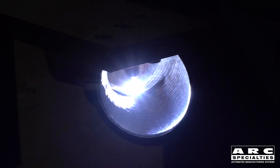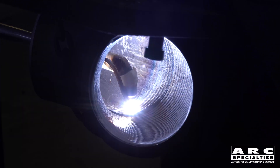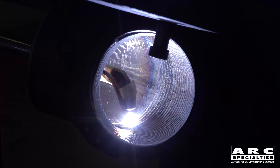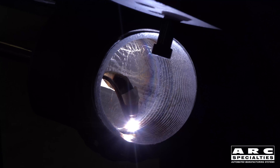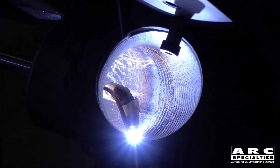This is our standard hot wire welding package. You can see the gas tungsten arc welding torch with the tungsten electrode, and behind it we have the hot wire feeding in. We're actually preheating the wire with low voltage AC power, probably around 100 amps, and this increases our deposition rate and decreases our dilution.